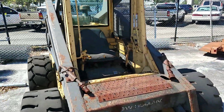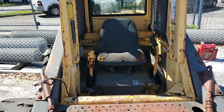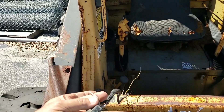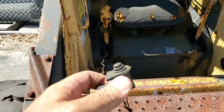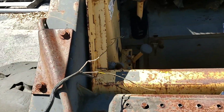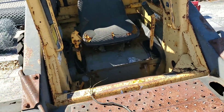The base of the seat is rusted out and that's the reason why the switch cannot activate. This is the switch — it goes underneath the seat. So when the person sits down, it engages. As you can see, the wire is cut, so it's not making contact to engage the hydraulics.